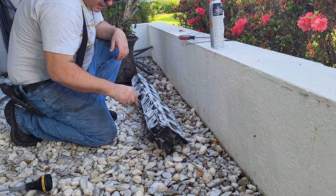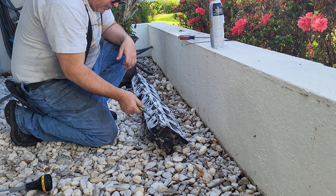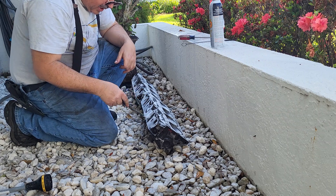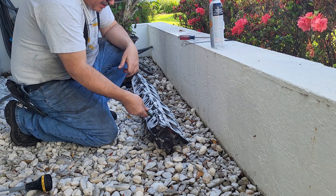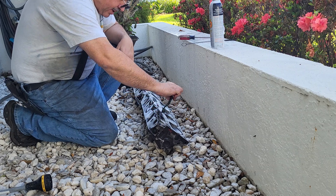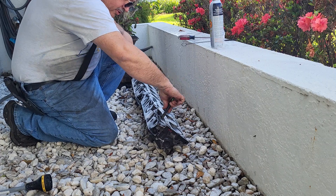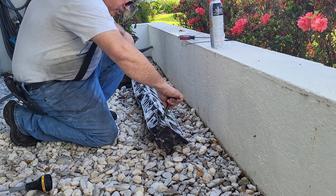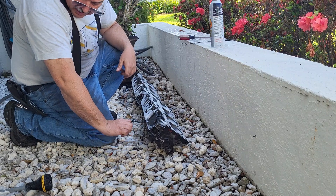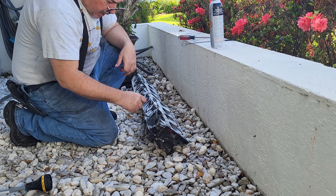Don't be afraid to get in there with the old toothbrush and give everything a good scrub — that's really what it needs. Now these actually need a tiny bit of epoxy work on the pinch, because the way these heads are designed the pinch isn't completely straight; it has a neck-down at the very top. If you watch DVS's original video on doing the open chambers, he blew a hole through — and I was following his design — and I think one or two ports I did the exact same thing, so these are going to need a little epoxy work.